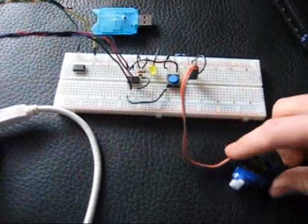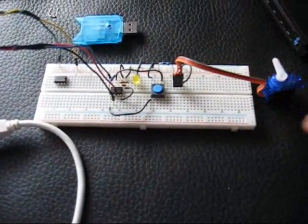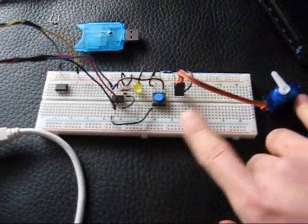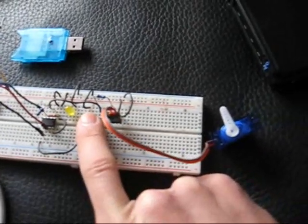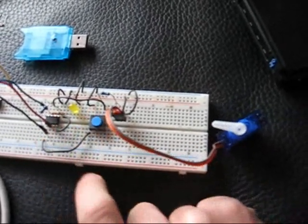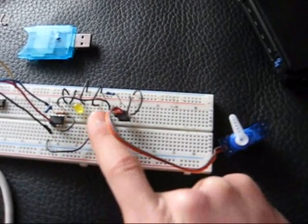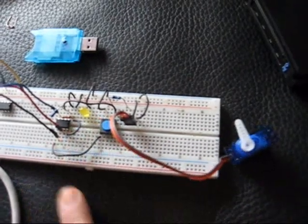And what will turn that control screw is a small servo like this. And what will control that servo is a small PIC microcontroller. And this is running a preliminary piece of code that I wrote that will hold the valve off until I can click the button to low, click the button back to off, and then from either state I can hold down for burst. So here I'm bursting from off, it'll go back to off.